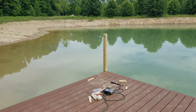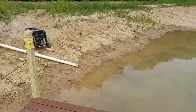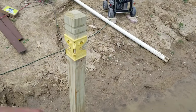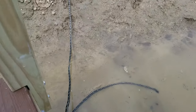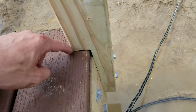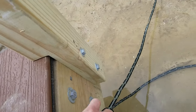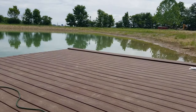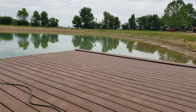I got two of my corner posts set and they are rock solid. Once you get that railing in there, this thing's going nowhere. Get yourself a post level when you do this in case you need to shim anything out. The notch that I cut just sits around the corner. I got the two 3/8 lag bolts on this side, same over here, and actually drove a couple three inch number nine screws in there just to really tighten things up. On to the other two corners, but I've got to finish putting down that piece of decking and shave that 6x6 down first.